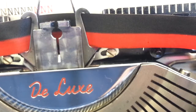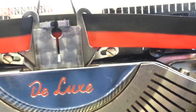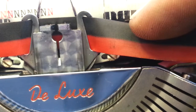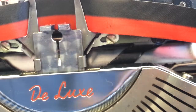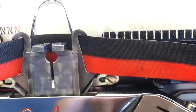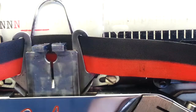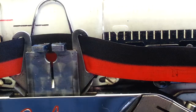Let me redo the black again. Put some ink on there. Put it on red. Make sure the underscore is making it. That's good. Let's roll this through and see if you can see it. There it is. Now it's got a little gap between the black. And then the final test would be the underscore on the six. Put this back to black — put it on red — and make sure the underscore is making it. If it was going too high, the underscore would have gone underneath the ribbon. We can try it in black too, make sure it's black and not red. That's good.